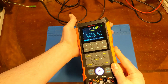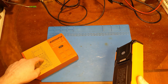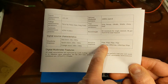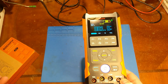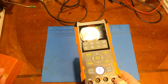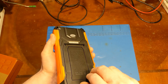The feel test — it's solid, it feels all right. It's got rubber on the sides like the smaller little brother. My biggest gripe with the smaller unit we reviewed is the signal generator output can only go to 3 volts. With the bigger model it is improved — this signal generator is supposed to go to 5 volts. The voltage output should be 5 volts on this unit, which is better. With only 3 volts you're really limited; 5 volts is better — at least it's TTL level. But for the automotive work I do, I really wish it was 12 volts. The user interface and display also look a little different, maybe some improvements.